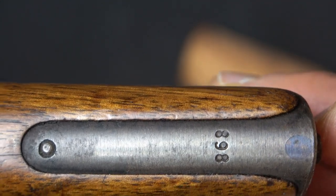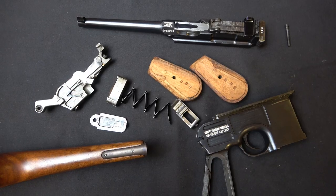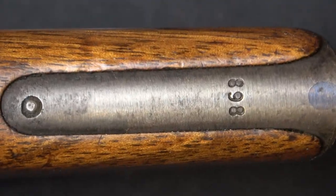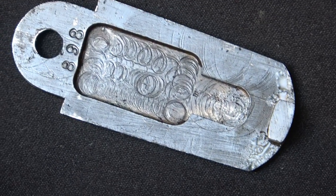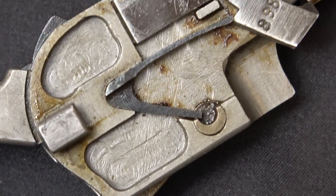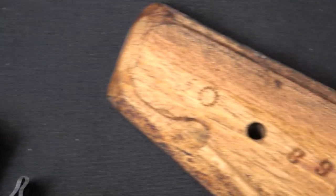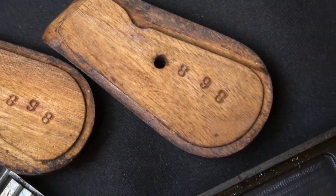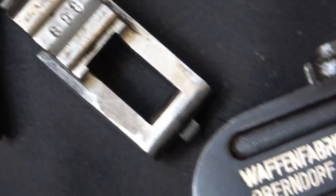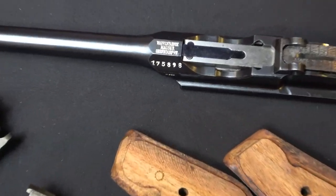The numbers should be nicely marked, and the polishing is perpendicular to the long axis of the lug. Here you can see the outline of the plunger as it's inserted into the top arm of the lug. So there you have it — a nicely field-stripped Mauser C96 where you can see the details of the stock lug, the floor plate, the subframe, the proofed follower, the grips, the locking block, and of course the details of the frame and the barrel extension.